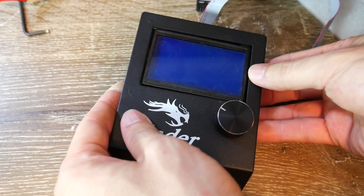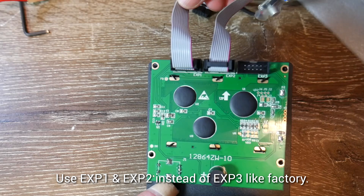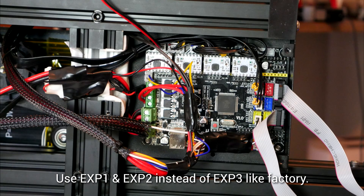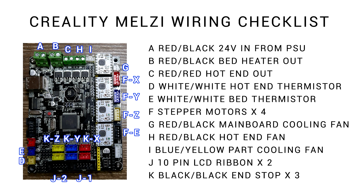If you do change your LCD, the four screws once loosened on the back will separate the LCD from the cover panel. If you're keeping the factory LCD like me, you need a second ribbon cable and you're going to match up expansion one and expansion two on the LCD and the mainboard. I used a little bit of electrical tape to tidy up some loose wiring. I have a wiring document linked in the description for you to print out alongside the other one to make your wiring conversion as painless as possible.